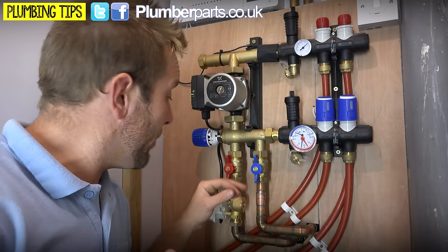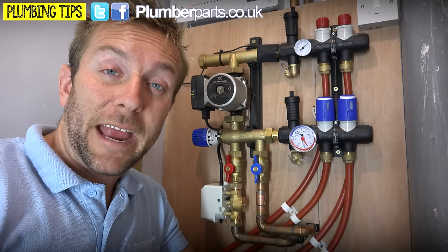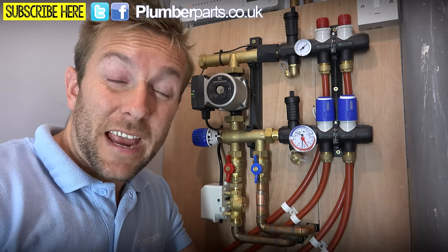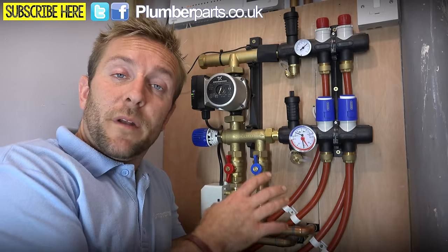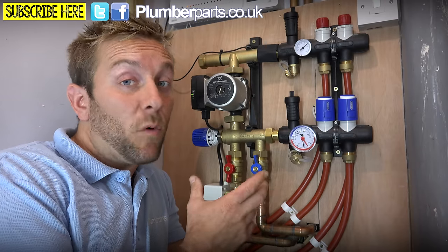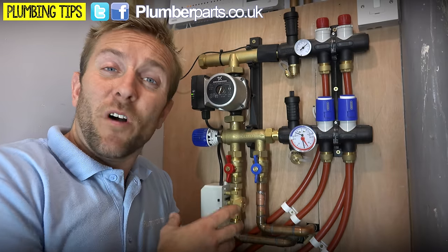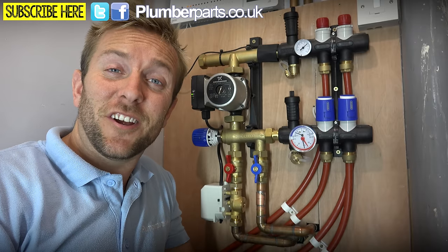It could run around there a little bit. So it's really handy just to pop a little two-port valve on there, zone it off properly, and it gives you a little bit more control over the heating system and makes it more efficient. Also, when it comes to our motorized heads, when the system's been switched off, they can still take quite a while to shut down as well. So with these sorts of systems, it's all about patience, okay? In the words of Gary Barlow, have a little patience.